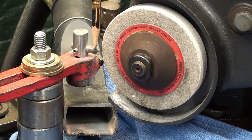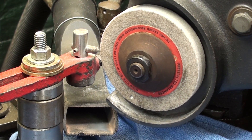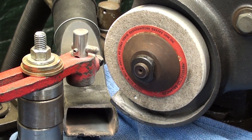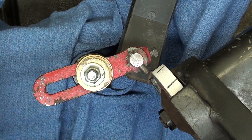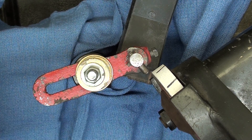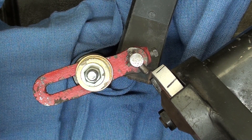In review: this is the diamond nib right here, and I'll be moving the wheel across the nib with the compound rest. The depth of cut will be controlled by the cross feed. Looking at it from an overhead view, I put several marks on the wheel so you can see when the cut is taking place. This will do several things: one, it sharpens the wheel; two, it shapes the wheel and makes it true; and thirdly, it will bring the angle of the face of the wheel truly in compliance with the angle we are trying to cut onto the lathe center.